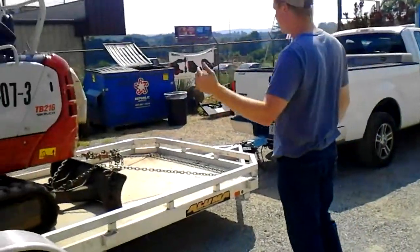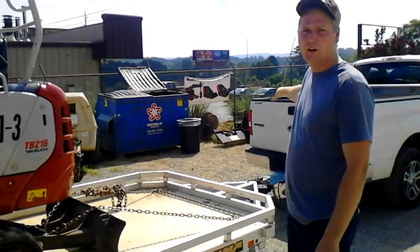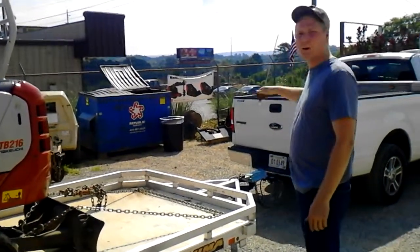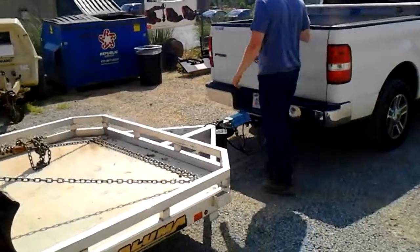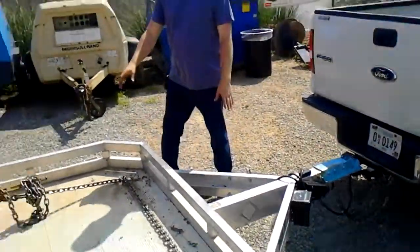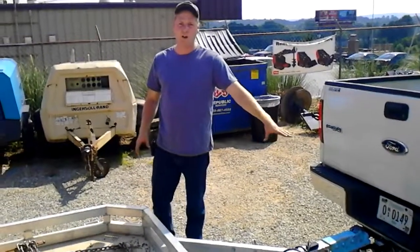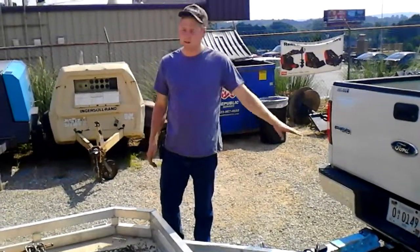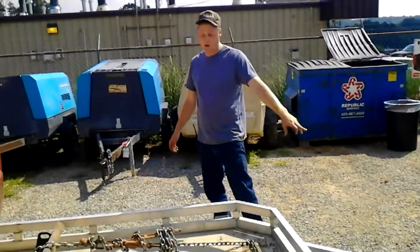First thing you want to do whenever the customer pulls the trailer back in, you're going to have them put the vehicle in park. As soon as you know the vehicle's in park and the ignition's off, come over here, double check your hitch real quick, make sure that everything's still down and connected. You want to make sure nobody messes with this hitch while you're unloading it, because it can pop up, hit the truck, hit somebody. Just 100 different bad things can happen. You just want to make sure that's locked down.